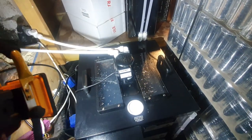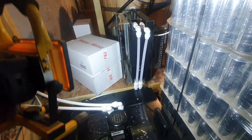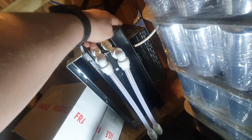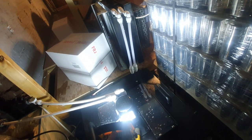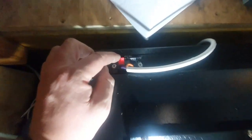And yeah, once it was unplugged I just wheeled it up here and wired up the electrics, which is 24 volts to that unit. I must note though — there's a sticker on the front here and it says on there that it's a 240-volt unit. It isn't — it's 24 volts. They've put the wrong sticker on. But you can see there's the 24-volt AC supply.